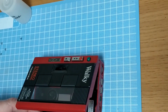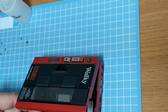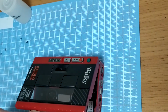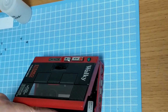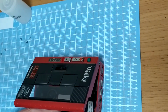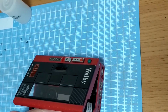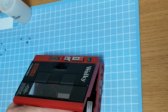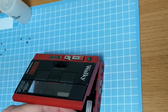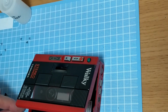And where possible, keep your screws separate so that you know exactly where they belong. Because once you get maybe 15 of these things and they get mixed up, it becomes very, very hard to match them exactly where they're meant to go. Some of these, it's not a problem. Others, they have the same thread, the same diameter, but the length would just be slightly different. And then something doesn't work the way it's supposed to. And if you can avoid it, you don't want to foul, because like I said, these things often have very small tolerances. Yeah, in here somewhere.